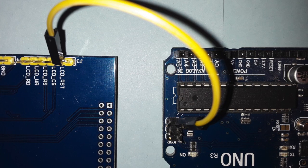I previously showed how it's possible to relocate the LCD reset pin to a different Arduino pin and how to bend two touchscreen pins so that the A4 and A5 pins are free to use with the I2C bus. In this update, I want to describe another way of accomplishing the same thing, but this time it's only necessary to bend a single touchscreen pin, the LCD reset pin.